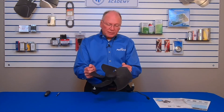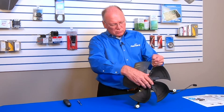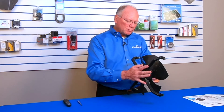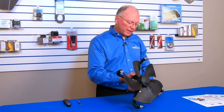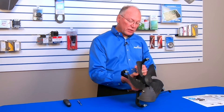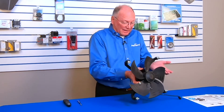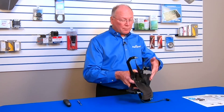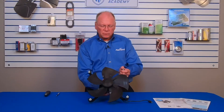Because it is an assembly, you don't have to take the motor off, take the fan blade off, and then reassemble the replacement motor to the mounting frame and attach the fan back onto the shaft. Once reassembled, you also have to make sure the fan blade is in the right orientation — but with this assembly, that's already done for you. It makes for a lot of time savings being able to replace a shaded pole or PSC motor with a complete ECM assembly.